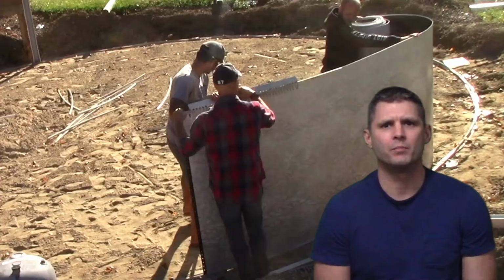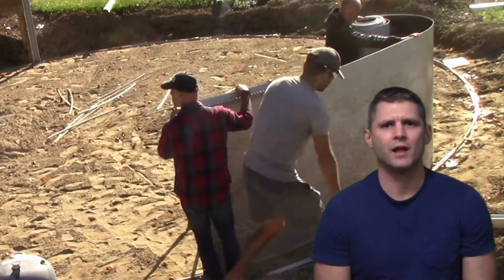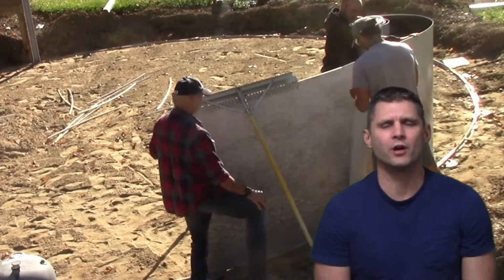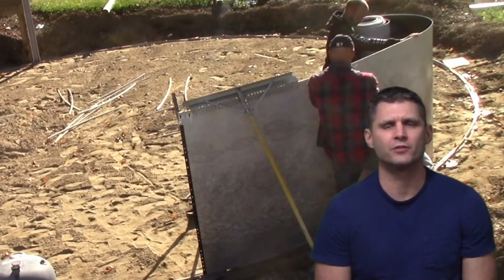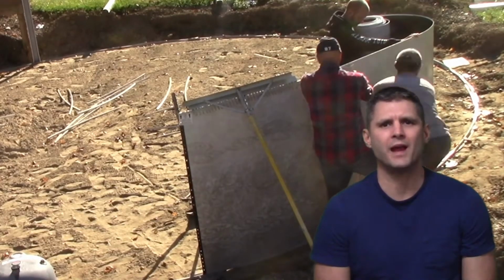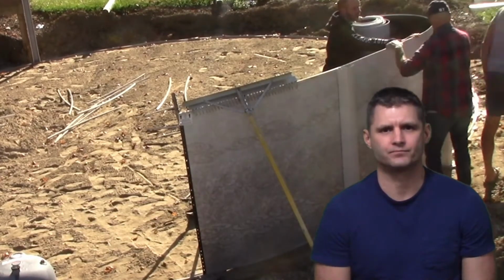First thing, be aware of the temperature. For liners rated 20 mil or less, the liner is best installed above 65 to 70 degrees. For 25 mil rated liners, the temperature should be 80 degrees or hotter.